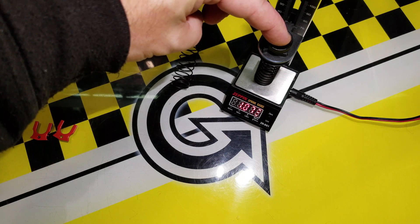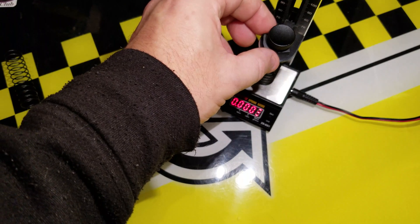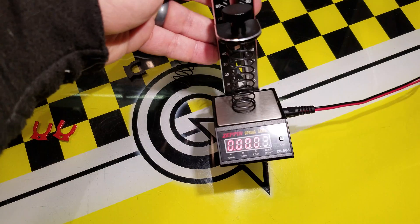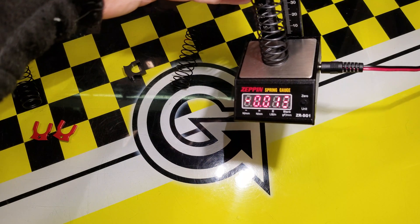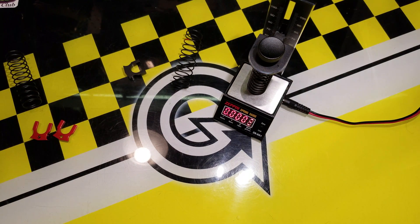This time I measured it 1.07 — that's 2.14. You can see that it's within 0.01. So that's the Zeppin Spring Gauge, the ZR-SG1. I'll put a link in the description to the manufacturer, and I'll also put a link to an eBay site that actually sells these — sometimes you can get them at a good price. They're about $40. If you like this content, just click the like, maybe put a comment and list more videos that you want to see. Talk to you later.